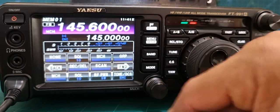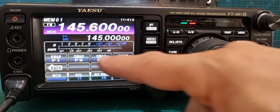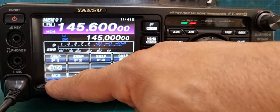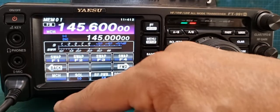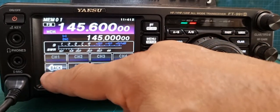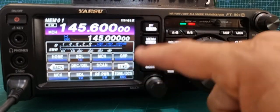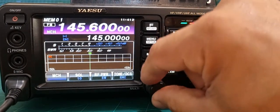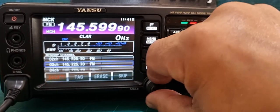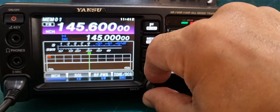So how do you add these shortcuts? Just go F menu, scroll right or left until you see swap. Once you've got swap, decide where you want it to be. Hit the button beneath — F1 — then cycle until you see memory channel, tap it and it just puts it there. Hit F menu again and now you've got a shortcut to your memory channel.